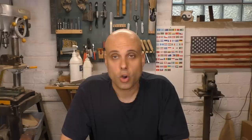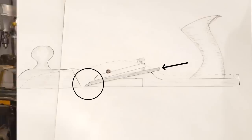I think there's got to be a reason why people don't usually make these planes in the home shop. In fact, there's two reasons. Problem number one: you can see that low-angle, 12-degree bed. Down by the mouth, the material of the bed gets so thin that if we made it out of wood, like most homemade planes, it would just shatter under the force of planing. No wood is going to stand up to that.